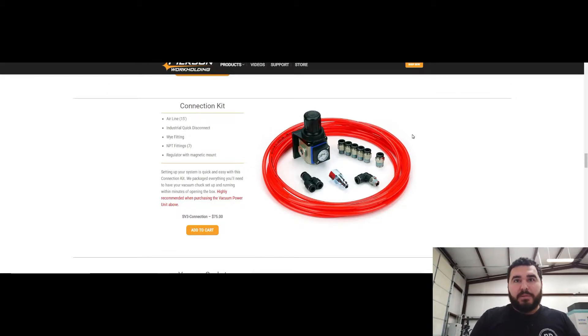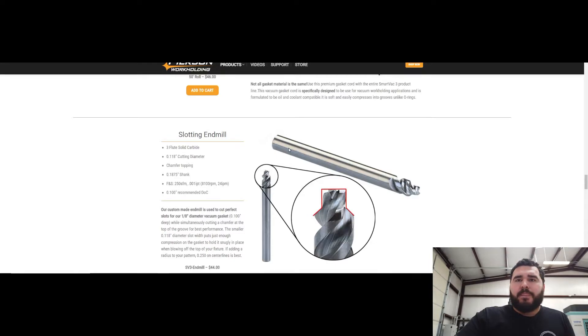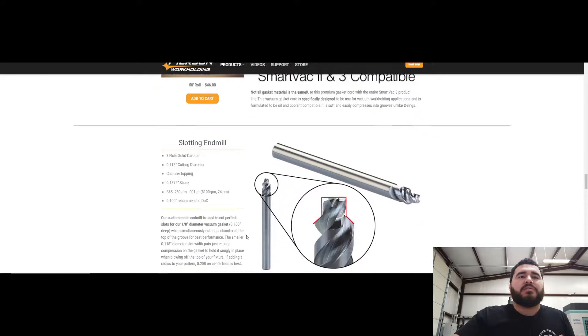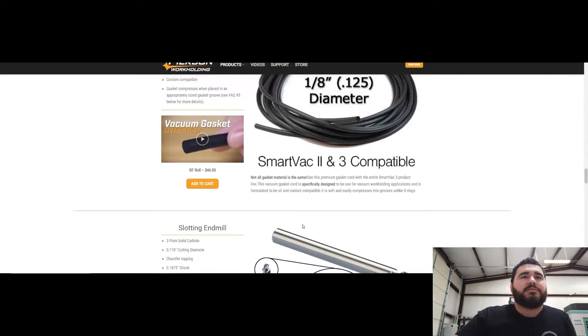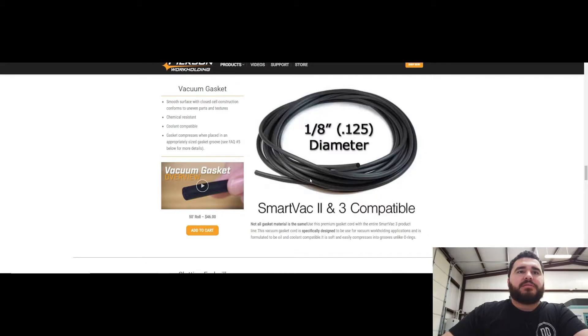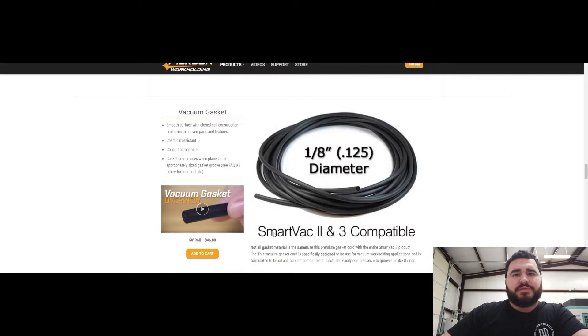What I did is I took the regulator off the bracket, taped the bracket to the machine, and put the regulator back on. It's a little janky but I just wanted to get something going — I'm not doing anything permanent my first time using it. I can replace the magnet later or create a better mount. I also grabbed their slotting end mill, which makes it so much easier to cut these grooves. You just plunge it into the part and cut at 24 inches a minute — it's a one-pass thing, deburred, worth the $44. I also ordered some of their 1/8-inch gasket — 50 feet — and I think I used maybe 10 percent of that on this plate.